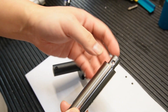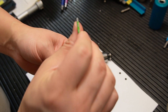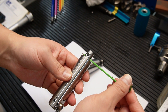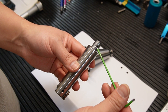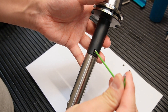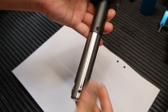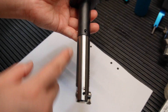In the screw position, there are two sets of holes. The first one is the cross holes here, and the second set is here. This second set of holes is used for stiffening pins. In our case, since we're doing fine bore applications, we don't need them — we only use the cross holes. They have a taper shape, so when you put it in the master shank and tighten the screw, the further the screw goes in, it uses a wedge phenomenon to lock the ball towards the master shank.